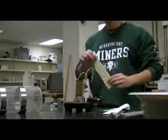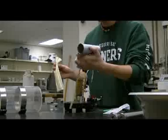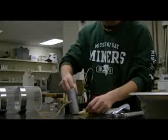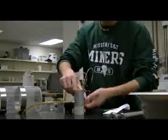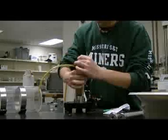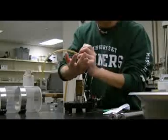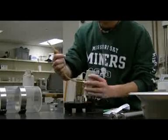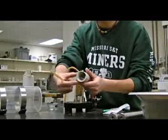The membrane has been soaked for 16 hours and we have to use this membrane expander. First, slide the membrane inside the membrane expander, flip it up, flip it down, and then flip this side down — make it smooth, like this. Now it's a very tricky part. Usually we connect this pipe to the vacuum so that the vacuum can suck the membrane to contact tightly with the inner wall of the membrane expander.